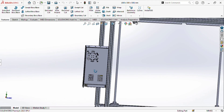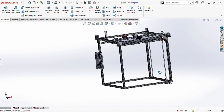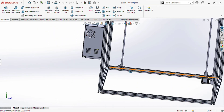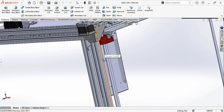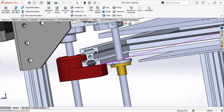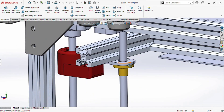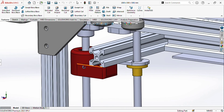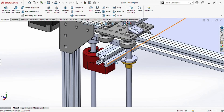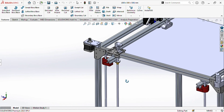This is the power supply — a 24V 15A power supply. For the Z-axis you can see I attached only one motor here; you can assume one is here, another is here, and the fourth one is here. I'm showing you just the mechanism: this is the lead screw rod with a brass nut, and it will attach with the aluminium profile like this. This part you can 3D print or machine it. This is the 3D printed part which has the LM8UU bearing inside it, which will slide up and down with this profile when the screw rotates.